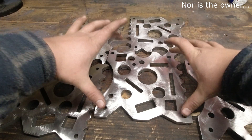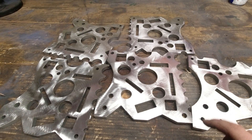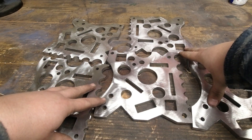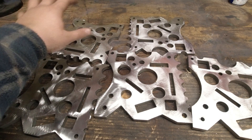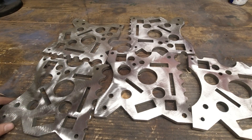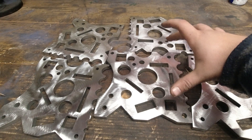So we have this — this is the washer plate. I don't know if you can notice these holes are different. This is what one, two — these should look like. And then we have the nut one, which we're going to tap one of these holes. So while I'm doing this, I'm going to move this one away in case I accidentally drill those holes out — I've done it before. And then we're going to open these out to look like those.